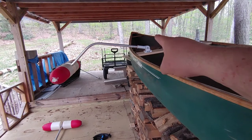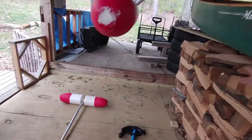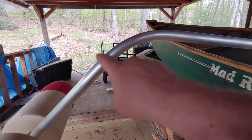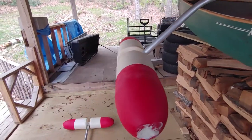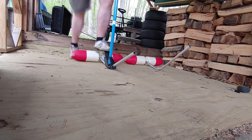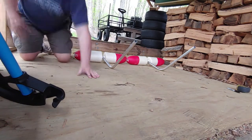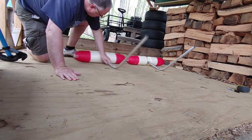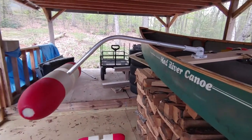As you can see with the flagpole, I'm up one set of teeth, and I can go down one more set of teeth, which will bring this down another 6 inches. It will be below this. So that's a nice aluminum tubing bend in these conduit pipe benders. So let's do the next one. We gotta match that bend. Number two is bent. So it's almost 45 degrees. It's about 40.